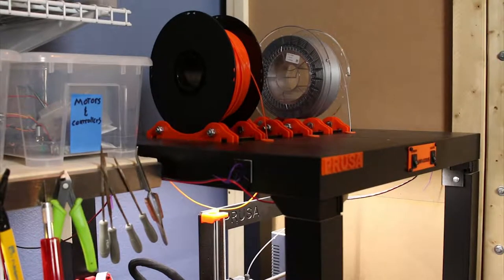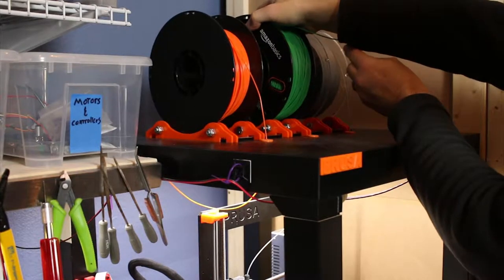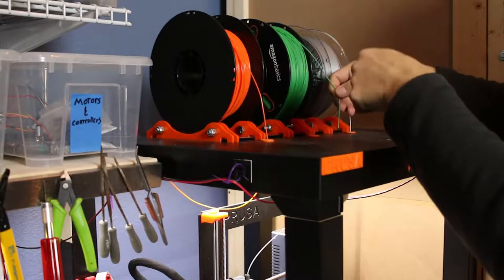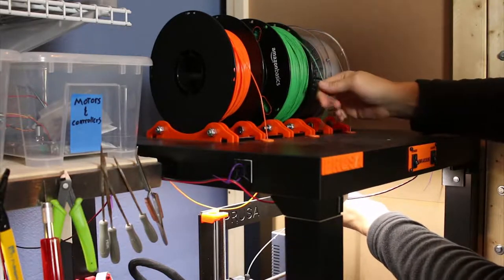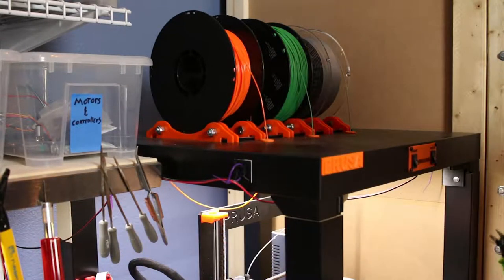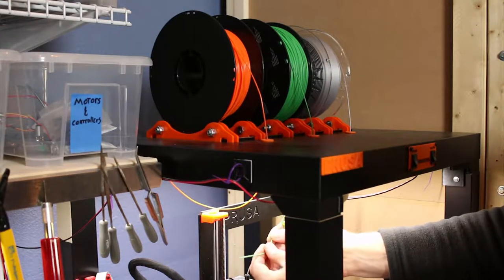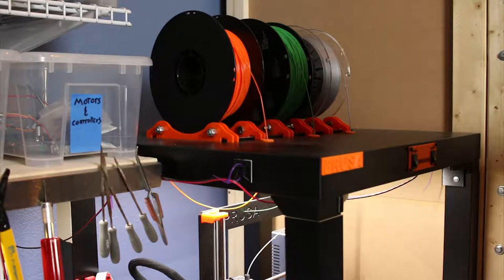This is my 3D printing rig here. You can see on top I have made some spool holders using some standard skate bearings. It's a product I was kind of trying to come up with. I've drilled holes through the table here and put these little guides in so I can just feed that right through. You want to clip some of this off at an angle. I don't know if you can see that just right, but if you clip it at the most extreme angle you can get, it will feed into here much easier.